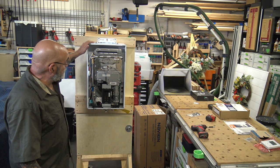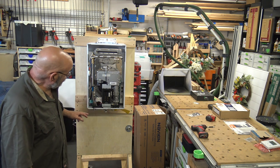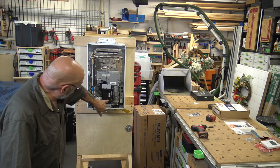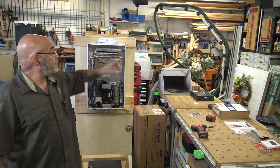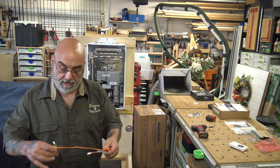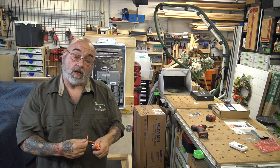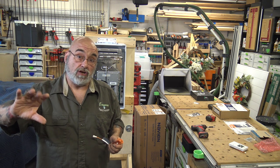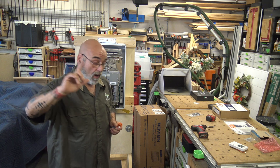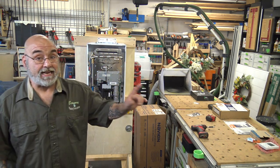Here is the inside of the unit. There is a control panel already mounted inside. You can run the unit using this built-in control panel, or you can plug the cord into the side and run it to the other side of the wall — or splice it to 18/2 electrical wire and extend up to about 100 feet into the house. You can put multiple controllers together on this unit. It also has recirculation capability with a dedicated return line.